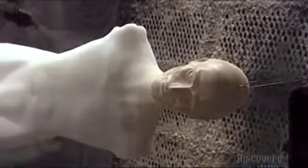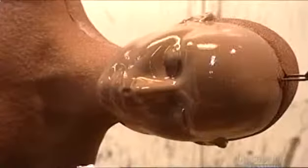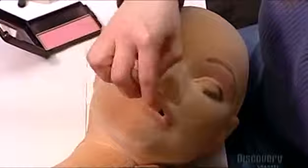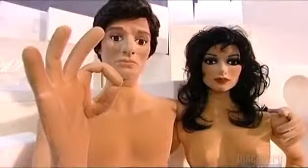Next, they spray the mannequin with flesh-colored water-based glue, then sprinkle it with fine powder made of tiny cloth particles. This is called flocking — it takes 12 hours to dry and gives the mannequin a protective, fire-retardant skin. This factory's flocking comes in 18 different colors, from a variety of skin tones to several vibrant colors. Before Lady Swing makes her debut, a makeup session: powder blush to color her lips and cheeks, water-based paint on her eyes, lashes, and brows. They add a wig, and voila — she's ready for her date with Mr. X.